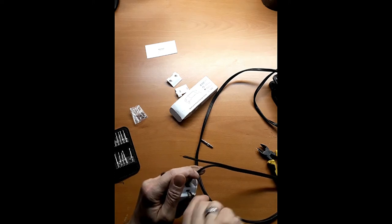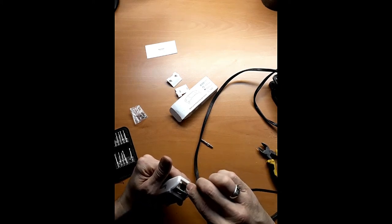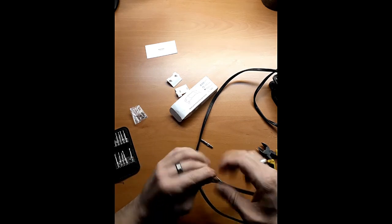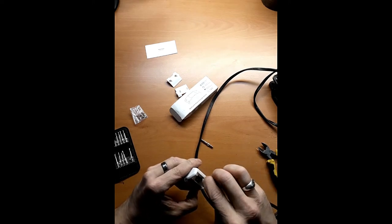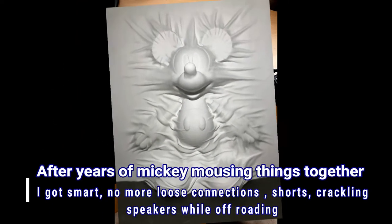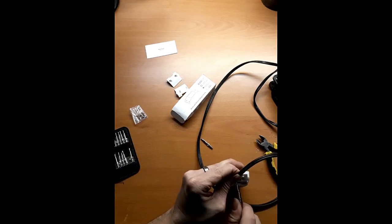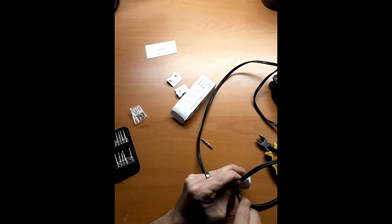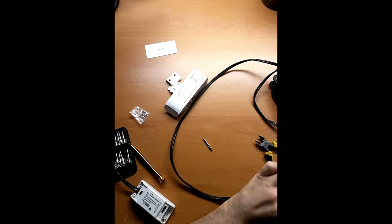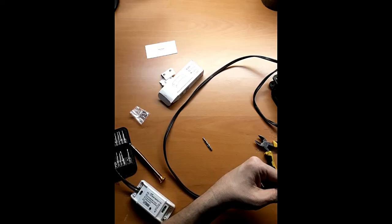It's a whole cut once, measure twice kind of philosophy applied to electric applications. So double check as you go along. If I was doing this for a more permanent installation, I would probably tin the wires going in it just with a soldering iron. That's me, I am like that. I do that with almost everything I'm putting together for a long-term installation. This I'm not, so I'm not overly worried about it, but I would in other circumstances. That's, like I said, just me. I'm quirky like that. I like to have the tinned wires and whatnot.